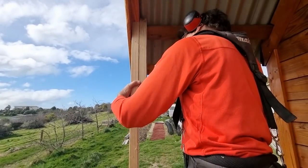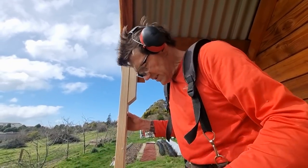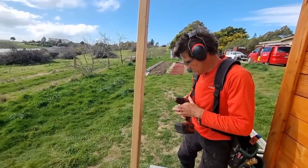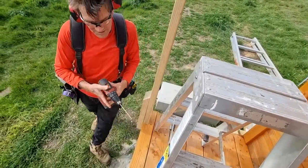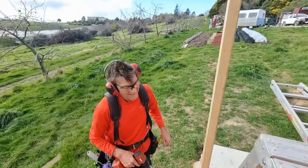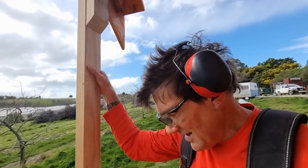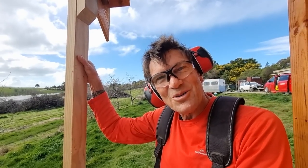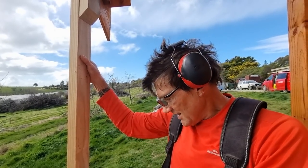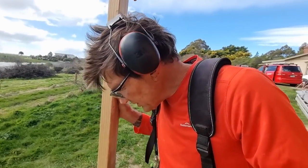Flapping. Yep. So, that's just basically a support. Right. It's attached top and bottom. It's not holding it up as much as it's holding it down. Right. You know, against uplift. Yeah, so this was the way we built our houses in Cairns because of our cyclones. You know, the wind, so we had to hold it up as much as you had to hold it down, or hold it down as much as you had to hold it up. So yeah, that's what this will do. I mean, 4x2, it's super strong for what it's doing, but it'll stop that noise.